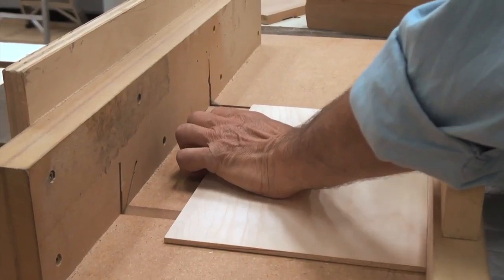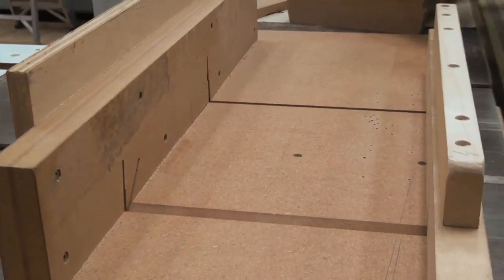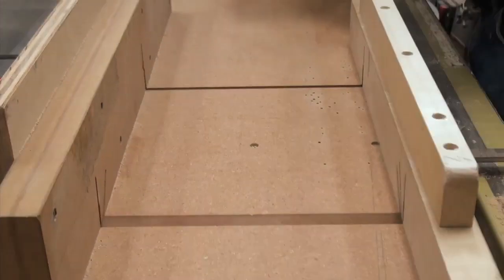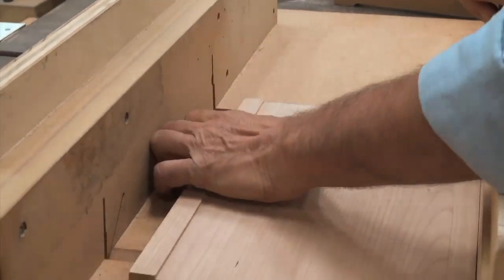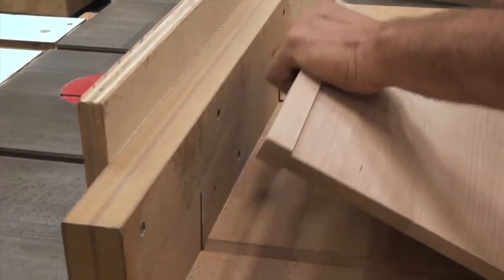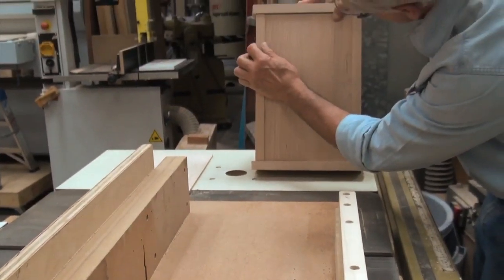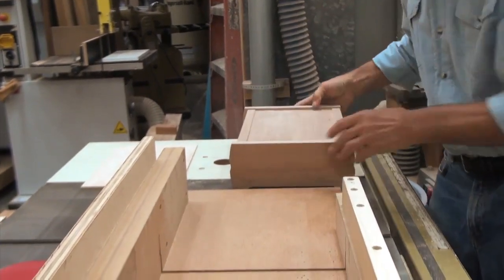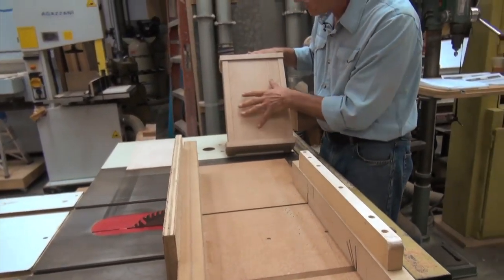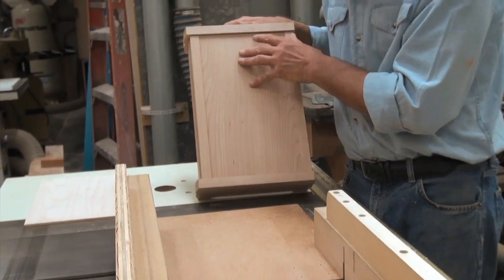Okay. So I'm going to be trimming the floor to fit into the box and the lid to fit on the other side. Good. The lid now has about a 1/16 of an inch gap, which I'll distribute in the middle. That'll be 1/32 of an inch clearance on either side. And it looks like I'm ready for final sanding and hinging the lid.